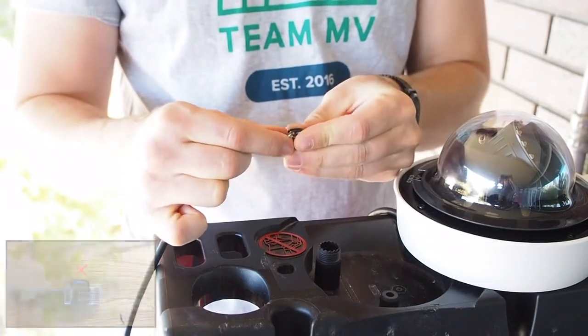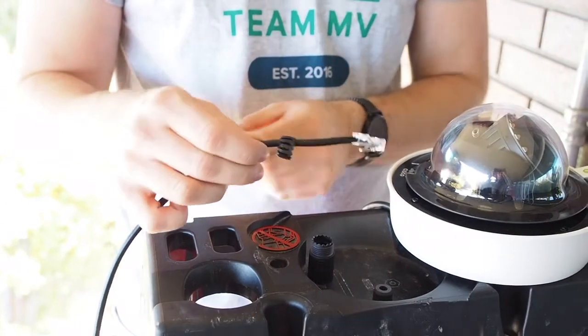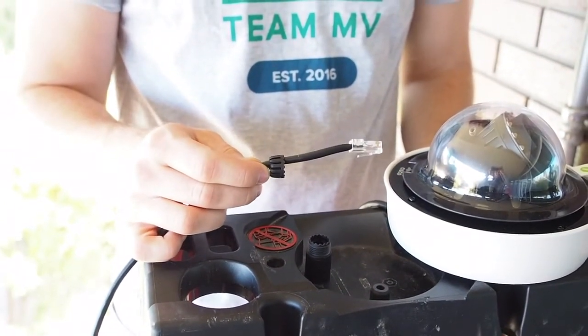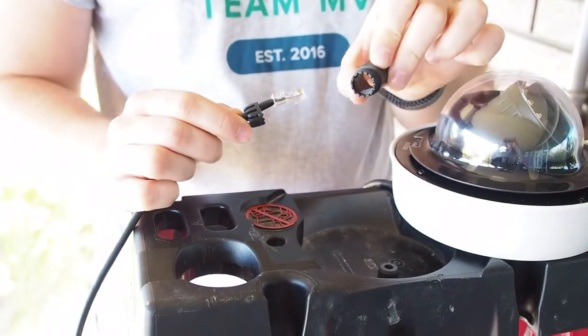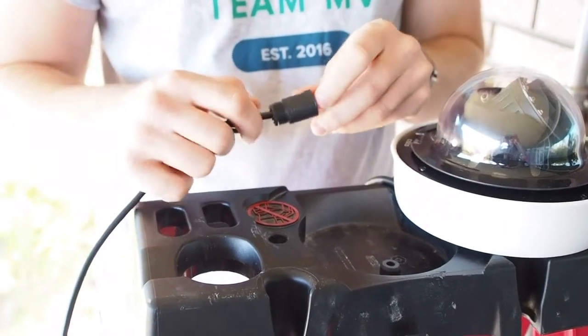Afterwards, hold the cable tightly in one hand between the cage and the sealing nut to prevent these pieces from getting stuck. Ensure you have room at the end of the cable to insert the next piece. With your other hand still holding the cable in between the sealing nut and the cage, put the patch cable through the coupling body, starting with the top end.